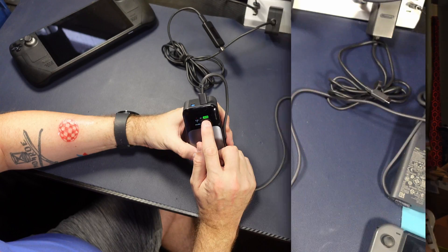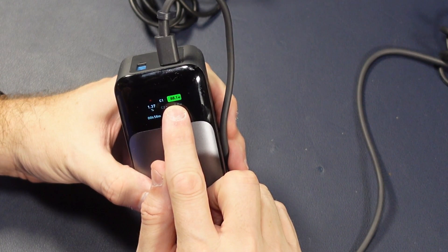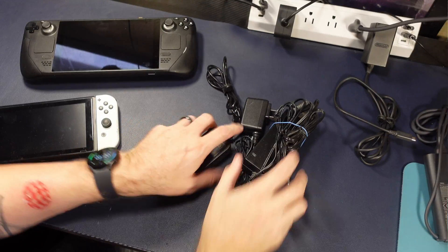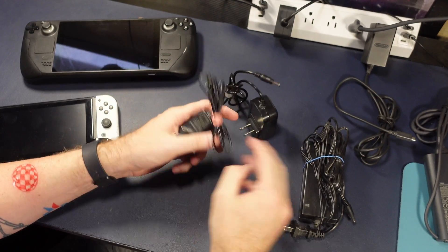This particular battery can take up to 140 watts, and if you can provide that much it'll charge a lot faster — but it will still charge at 45 watts. If the battery's logic detects it's getting too hot too fast, it negotiates a lower power supply, knocking it down to 20 watts until it cools off. When it cools, it re-requests the full amount — 140 watts — and gets back the 45 watts the supply can deliver. That's a neat feature that none of those old power bricks had. With those, it's all or nothing — you plug it in and that's what you're getting.